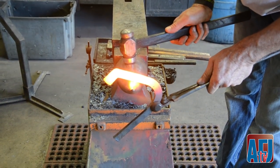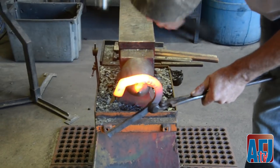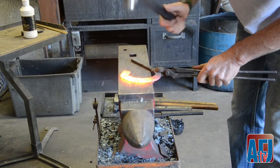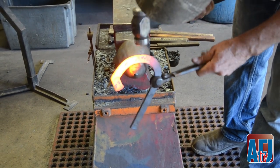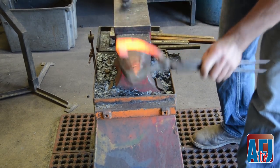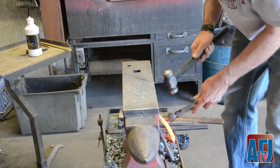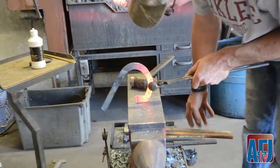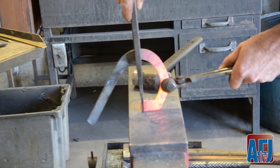Have it above, parallel to the ground. Hit with my hammer flat, come around and then sweep it around. I'm going to open it up a little bit and do it again, sweep it around. So then when I stick it on the face of the anvil, my bar should be square, and my line should come straight through my scarf. And I should have half a shoe.